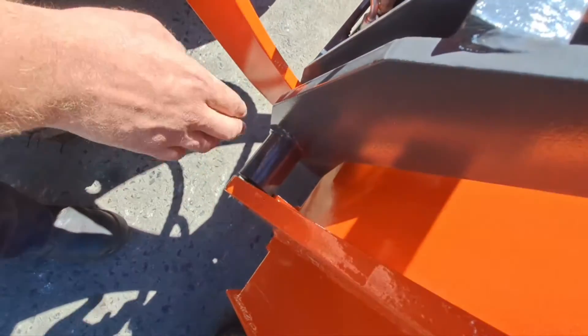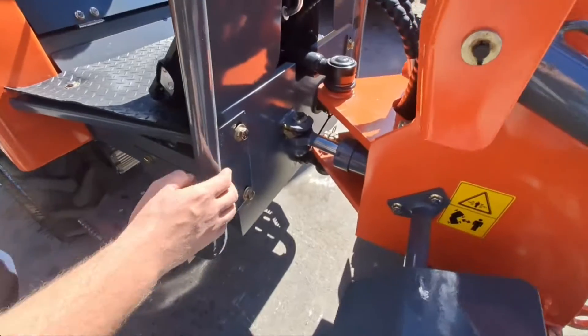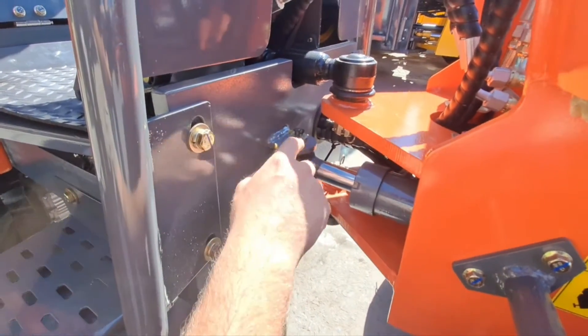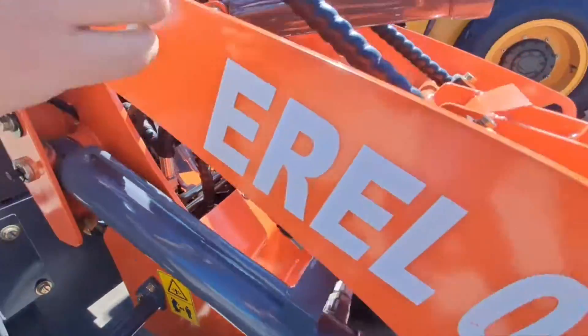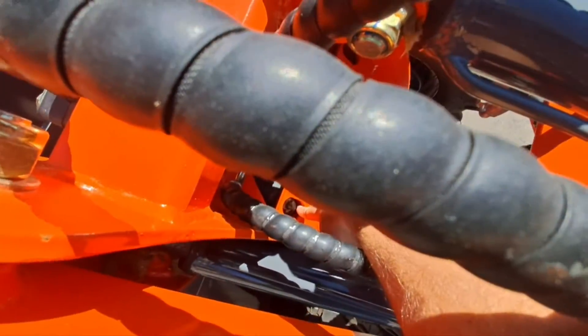It's on these pins — once you detach your bucket you can see that. In your center steer you have quite a few. There's five grease nipples here. You have two on your cylinders, one here, and one — you lift up this bucket and then you can reach through that hole there. The other grease nipple is right there.